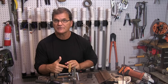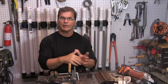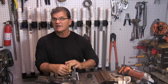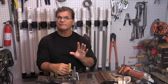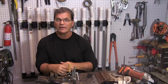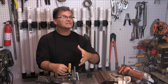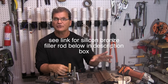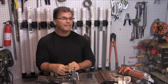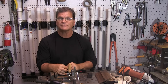You can do a lot of cast iron repairs, especially ornamental stuff. It's good for artwork — you can overlay on steel or join copper, brass, or bronze to steel, so it really lends itself to artwork, belt buckles, things like that. But it's not as strong as weld metal; you got to be aware of that. You would not want to braze a lifting lug on an engine hoist using silicon bronze. It's got its limitations, but it's got its usefulness also. I like to keep a pound or two of it around in different diameters — you don't need 50 pounds, a pound or two will last you a long time usually. That's what I have found the uses to be, and I'm sure there are many, many more. I hope this helps. See you next time.